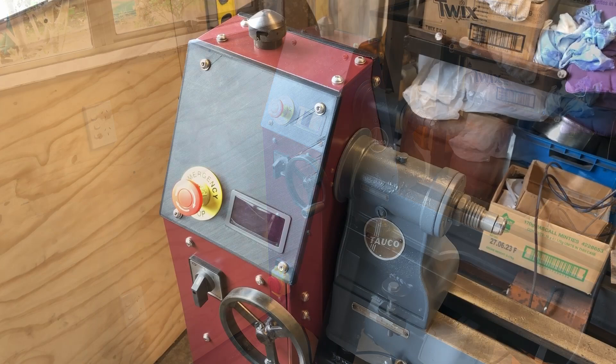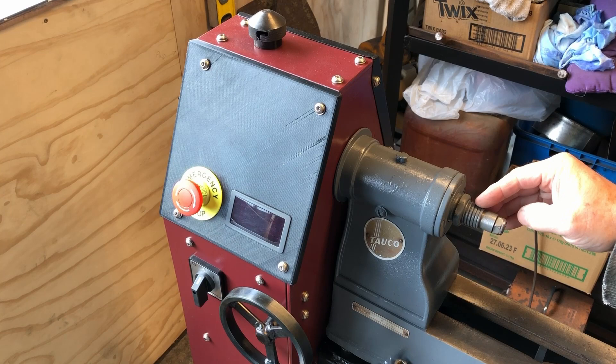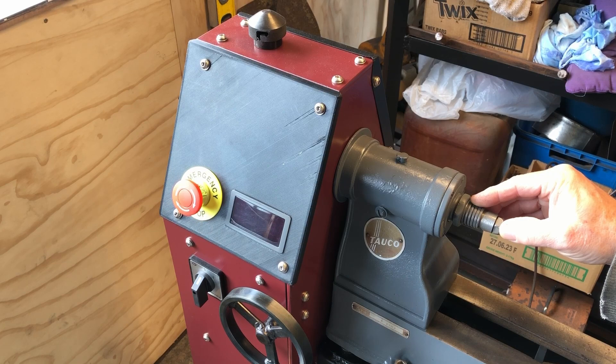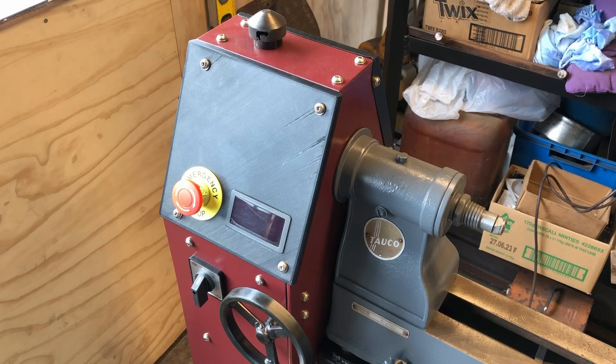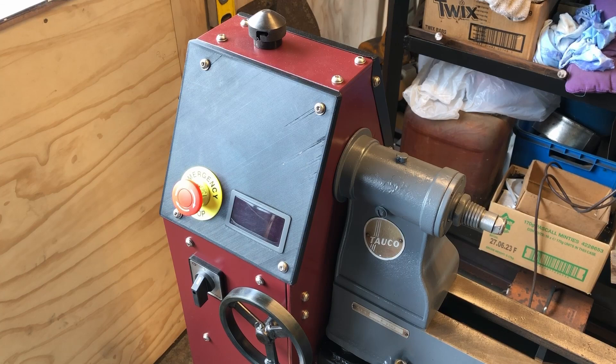In this video I want to work on the spindle. I actually have to make up a new spindle. A couple of reasons: one is the thread on the end here is kind of stripped out, so it needs to be built back up, turned down, and the threads cut back in. But the main reason is because the original spindle here is not long enough for all of the sheaves and stuff that I have. So I decided just to make a brand new spindle to the specifications that I want, providing it fits inside the housing and works with the bearings — or possibly I might need to buy new bearings. I'll take some covers off and the back cover and the front part off, and I'll be right back.